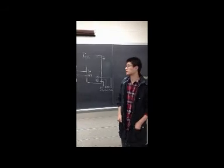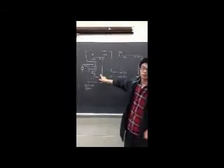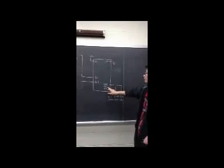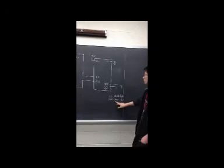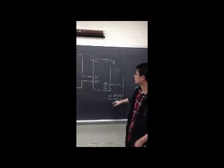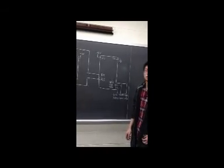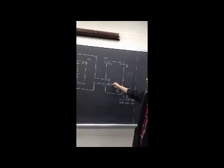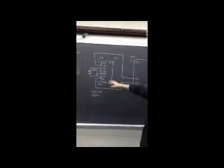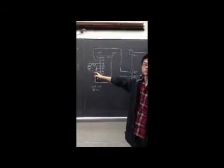And here is the figure of the motor drive and the PIC, the wire connections. Here is the PIC, here is the motor drive. We get the input signals from RB4, RB5 and RB6, which are the left, middle, and right sensors, and you can get logic values from them. Then we use the code to decide how to drive the motors. The outputs are RC4 and RC3. RC4 is connected to 1A, and RC3 is connected to 2A, which influence 1Y and 2Y to make the left side motors drive forward, stop, or backward.